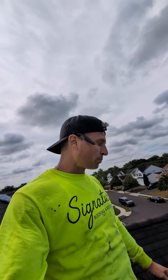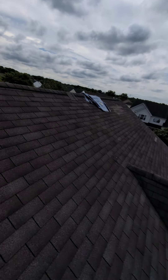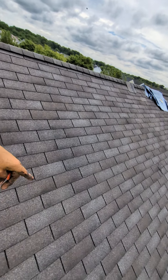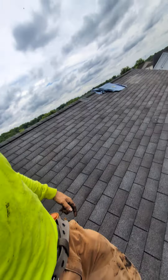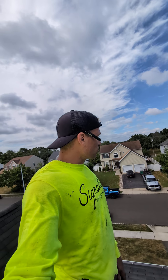So we're in good shape. We have everything patched up on that back end. Since we don't have one missing, we'll just take a cap nail and some muck and get it down. After that, we'll get cleaned up, clean these gutters out, and get on our way for today. Pretty much all wrapped up — hopefully that was helpful to you guys and gave you some insight on how to make these repairs correctly.